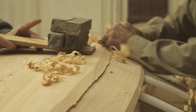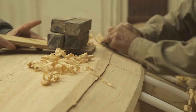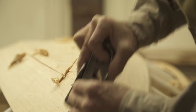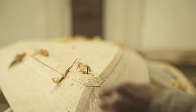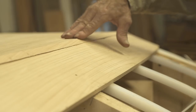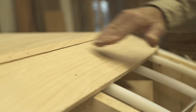I'm just finishing up the last few strokes with the hand plane. I've got the very bottom of it nice and even with the edge of the garboard plank, and it looks fair and true. I don't expect there's anything else I'll have to do to it, but I am going to inspect it just to make sure. I think it's complete and now I'm going to show you how the garboard plank goes on and covers the edge of the bottom plank.